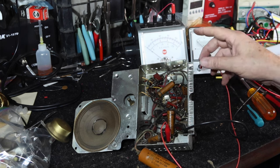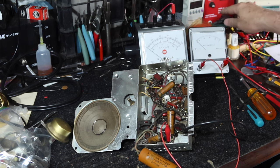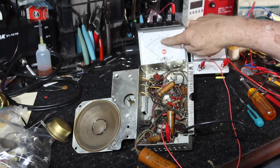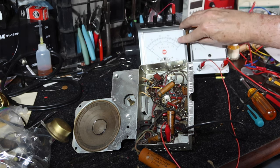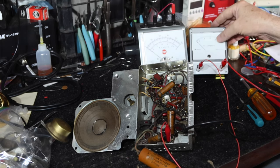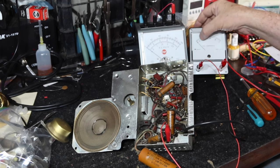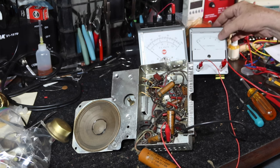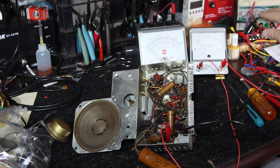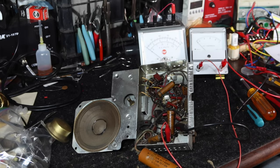But anyway, just so you know, I have an isolation transformer back here. I have a dim bulb up above it that's in the circuit. You can't see it. Over here, the red box is a variac that I can use to bring the voltage up slowly. You'll see the voltage going in on this. That's 120 volts right here. This is an AC ammeter where we can track the amount of current going in. It's 1 amp full scale. I think we should be expecting it to be around 0.3, somewhere in here. This is mainly so I can see if the current's running away from me, so I can keep the voltage down low. I've also got a panel over here with a 1 amp fuse in it, but with all the dim bulb and everything, it's very unlikely that'll ever happen.